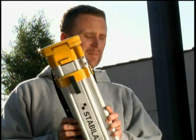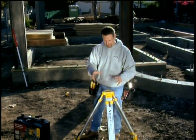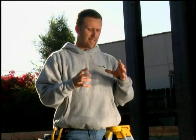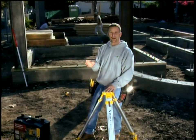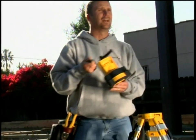The only way to check a foundation for level used to be with an optical transit. We'd set up a tripod and put an optical transit on there. The problem is you have to level it — it has a bubble and you have to keep maneuvering it until the bubble stays in the middle at all times. And if somebody kicks the tripod it knocks it out of level. Now the modern way of doing it is with a laser.